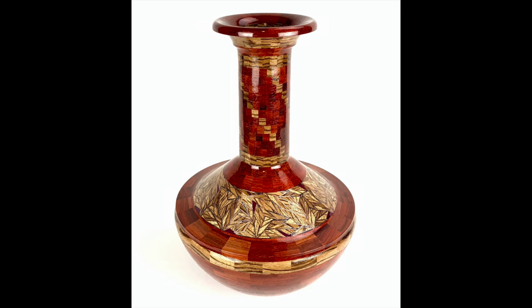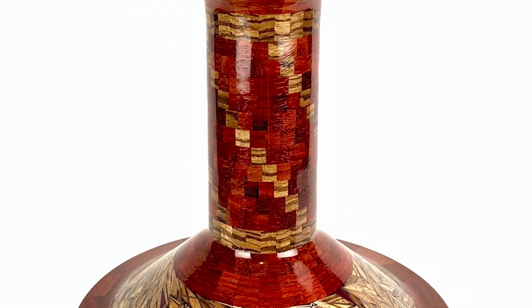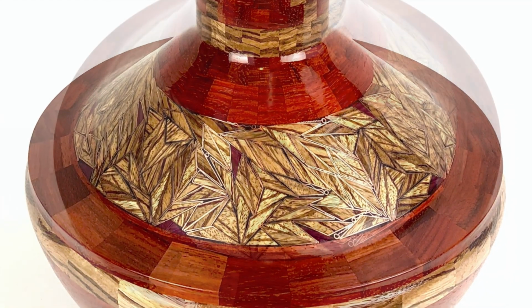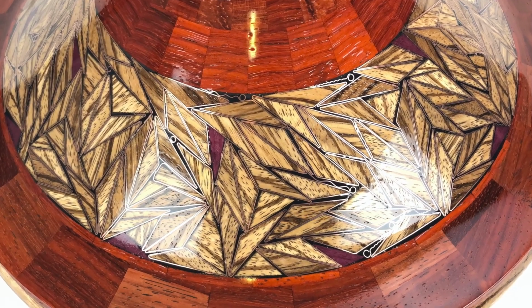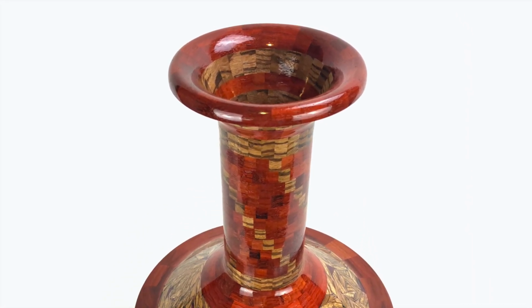And there he is, Mr. Majestic. I'm very pleased how it came out. And by using only 3 light layers of lacquer, I still maintain that wood grain. I like to feel the grain in my piece. The majority of my customers love this finish as well. Too many coats of lacquer will give a plastic appearance.